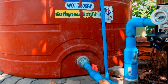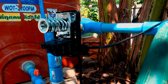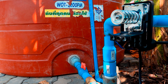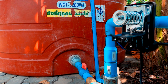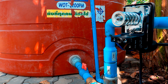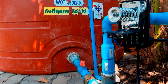You might notice that this is a half-inch diameter pipe. In Thailand, they frequently use half-inch diameter pipe. One of the reasons is that the city water supply is not capable of supplying a lot of water, so they want everybody to use half-inch diameter pipe. That's okay because you don't really need much more than that. In Western countries they use one-inch, which is kind of wasteful. Half-inch supplies enough water for us — I'm sure it would for anybody else. Also over here they don't use copper pipe; they use all PVC pipe. This would not be code anywhere in the Western world, of course.